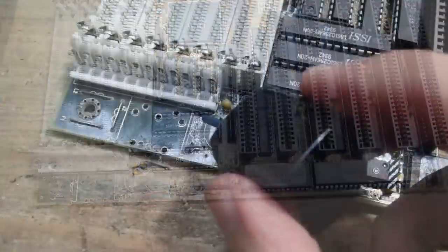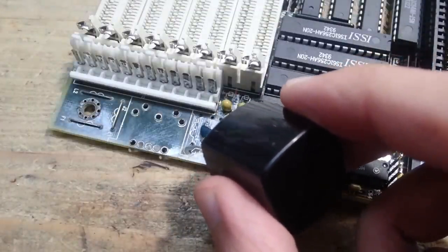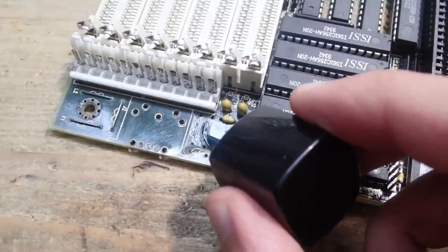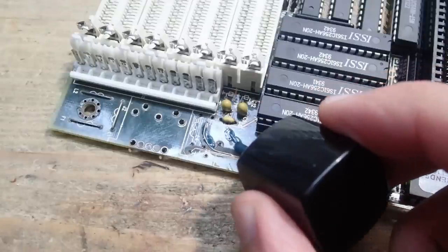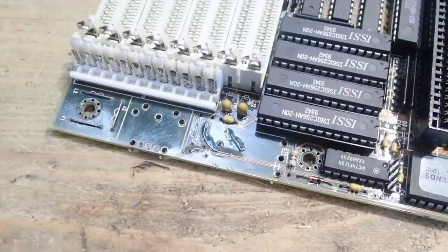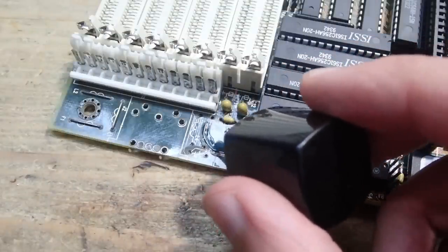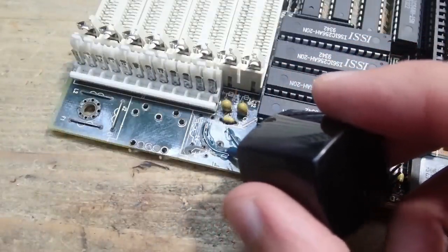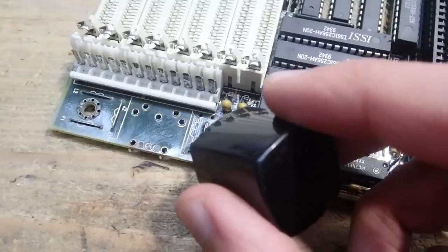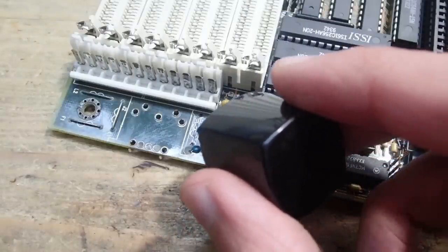Since the battery is usually located near the keyboard port, such damage is very common, and I showed it already in a couple of other repair videos. The restored traces with a solder wire are weakened and could be ripped off easily, so to give it a little bit more stability, I always cover such places with some nail varnish, which I initially stole from my wife. But as she realized it, the robbery was turned into a graceful donation.